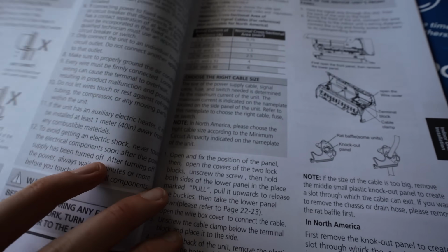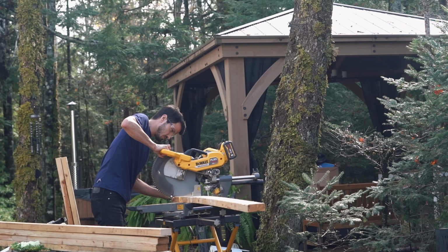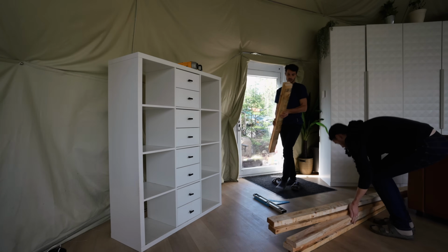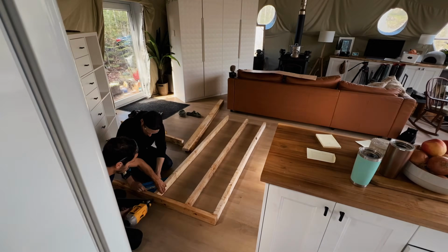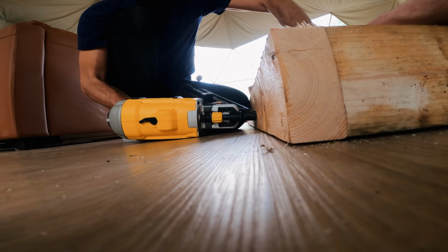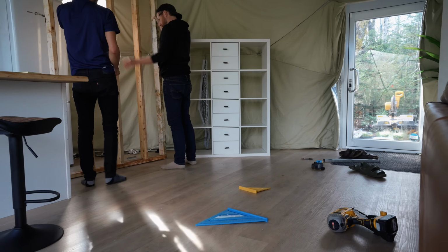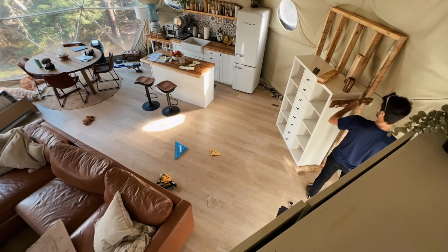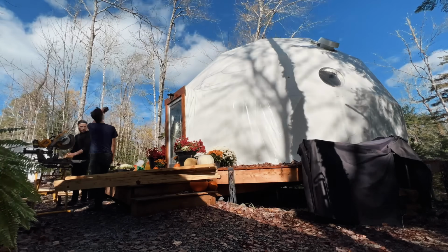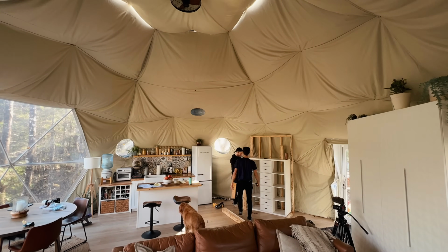Okay, so what are the measurements? If we do 3.5 inches here, that's a 2x4, because when you take off the frame, it's not a true dimension. So they would just go this way, like the framing goes like this on the side, right? Mm-hmm. So then we go up 57.75, and we hit this shelf unit that's existing, and it goes over, right? If we went, say, 4.5 feet instead of the full 5, then this comes to 54, right? So then it would come here. So we go 44 inches. And then we would have another one going up here, a 2x4. So then that's 3.5 inches.